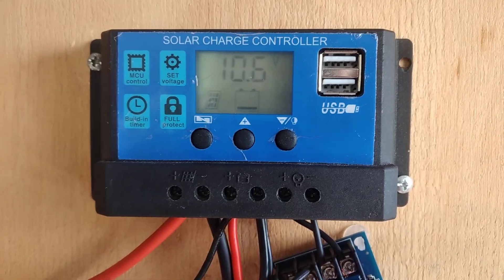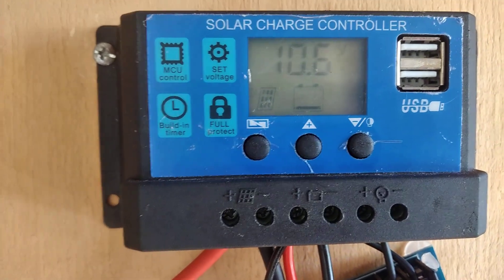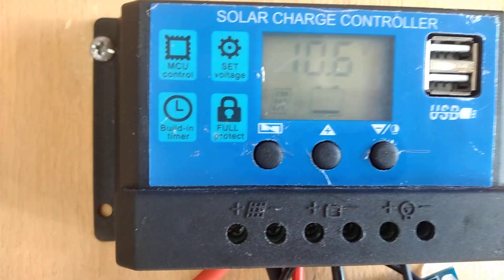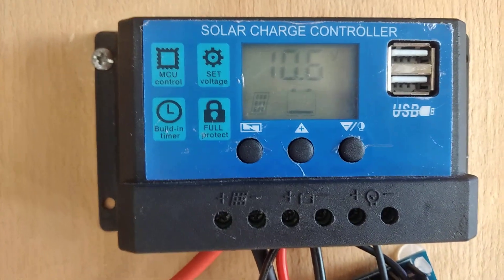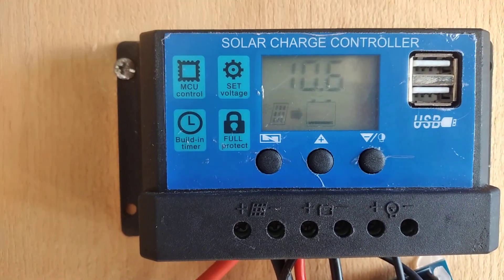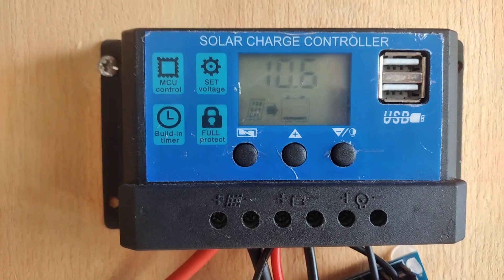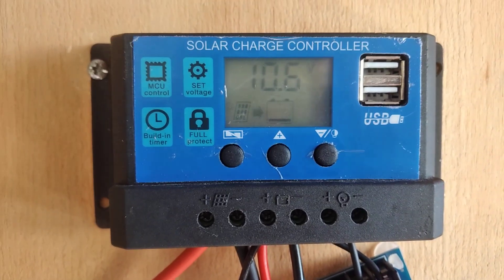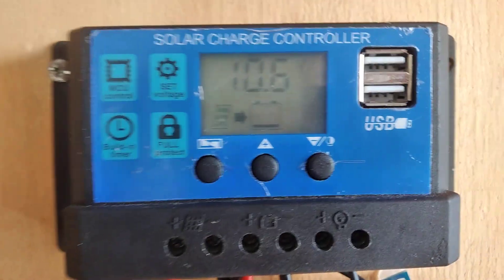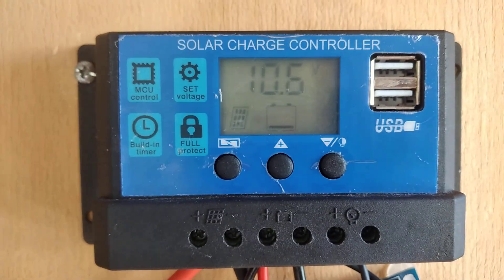Hello YouTube viewers, another video for my channel. In this video I have a solar charge controller I purchased from eBay. It says it's an MPPT, not a PWM — I also use PWM but that's for smaller systems. MPPT is better because when the voltage is reduced for charging the batteries, it will also increase the amperage for a better charge. You can see the different protections, but the main purpose of this video is how to use it.